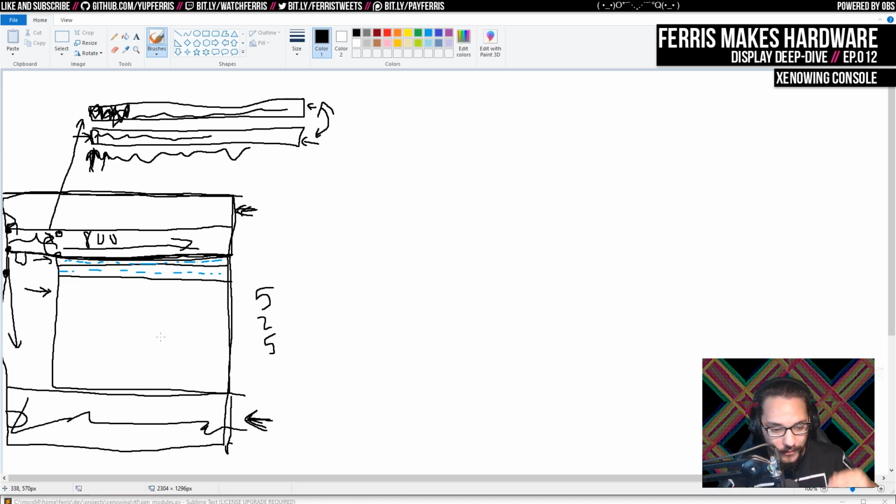But yeah, the main reason why we want to reduce bus bandwidth is it's a shared memory architecture. So this memory bus has to be multiplexed, shared between the CPU, the GPU, and the display unit. The display unit's again just pulling pixels out of memory to give them to the screen, and that's very timing critical, so that one always has priority. Then the GPU needs to put data into this frame buffer, which is a faster way to do that than the CPU.